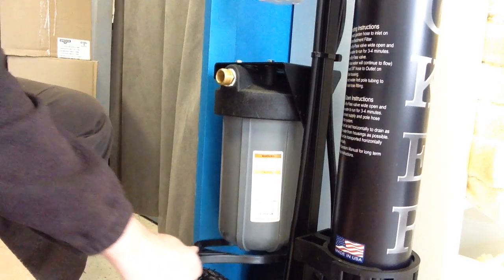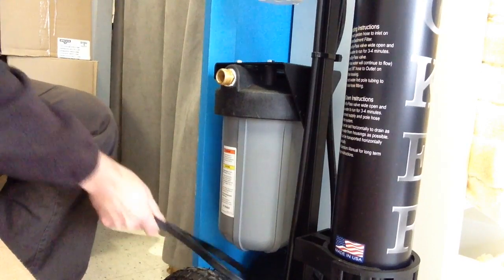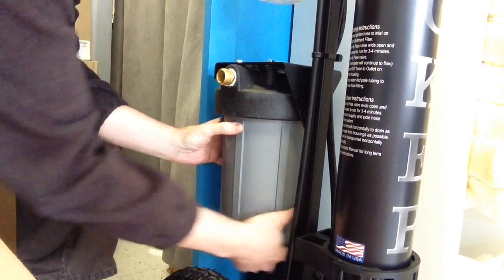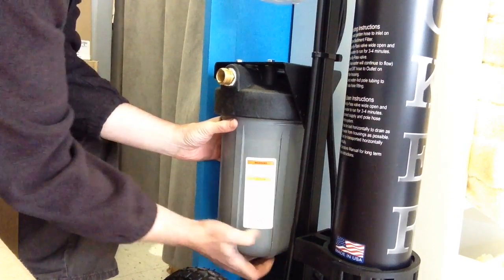With the Tucker Pure Water Cart, you should be able to achieve spot-free window cleaning results with TDS readings as high as 10 parts per million. But should you go over that, this is the time you'll want to be changing your DI resin.